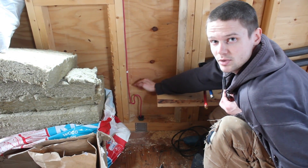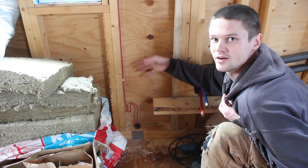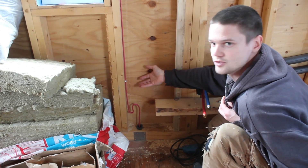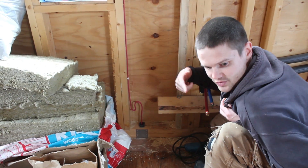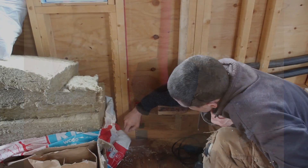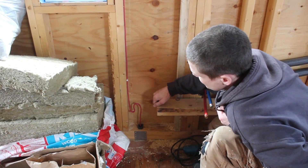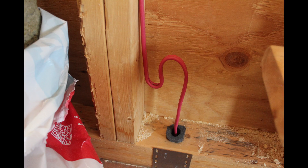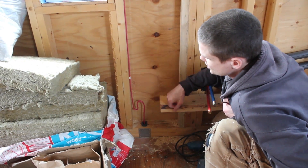This is going to be for an outside plug. We've talked about being able to plug in our induction cooktop outside on the table while we have a barbecue and do some outdoor cooking during the summer months — and just having a utility plug outside can be useful. It's 12 gauge wiring and it's going to be a 20 amp plug. Just as we've done elsewhere going through the flange, we've lined the hole with some plumbing insulation to cushion it and keep it tight. We've put some protection plates in front because we don't know exactly what kind of baseboard will be affixed down there. And I've left a service loop the same way I do when entering boxes, so that if anything were to happen to the wires inside, there's the option to pull a couple extra inches through to work with.